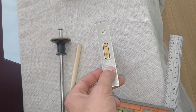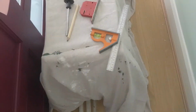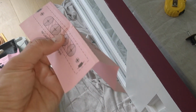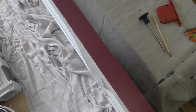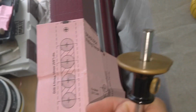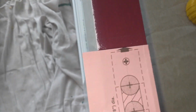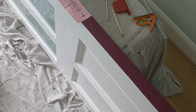Union is a pretty big brand in the UK for locks and bits, and I highly recommend them. This isn't sponsored or anything, but they give you a whole load of instructions and templates, which just makes life so much easier. This is a standard size door, 47mm thick. When you line that dotted line up right on the edge, you're bang on the middle, which is just perfect. So then all you need to do is figure out how far up or down you want this.